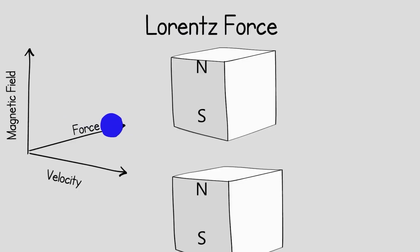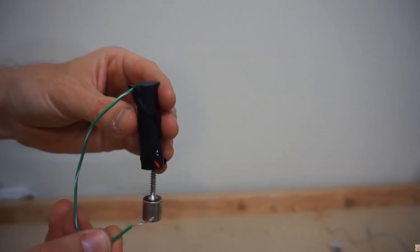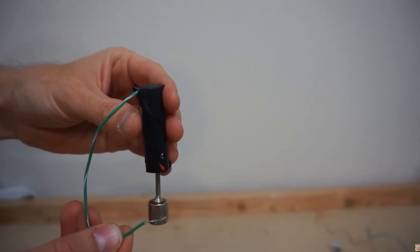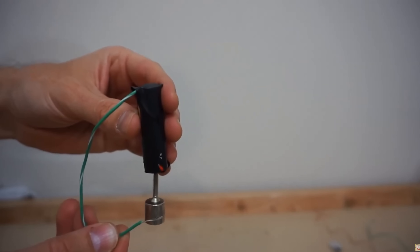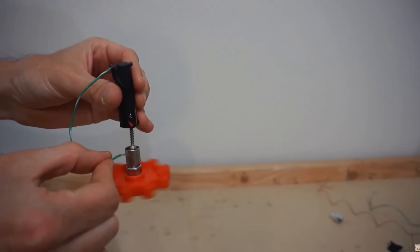But with an electric motor we don't need pistons, so we don't have to change linear movement into rotational movement. We can just start with rotational movement. The reason is because in a direct current motor, the Lorentz force always moves at right angles to the current flow, so it's really easy to get things to spin in a circle. For example, a homopolar motor like this one can be made just by sticking a magnet to the end of a battery with a screw and then flowing current through it.